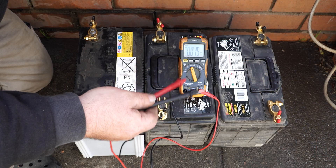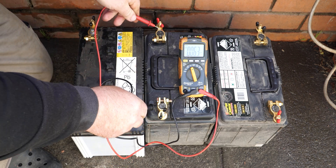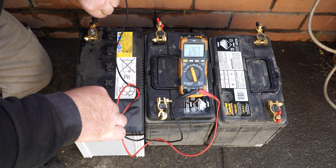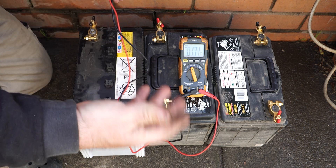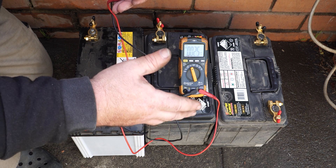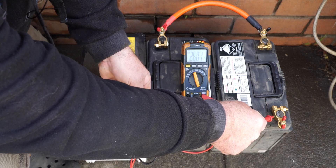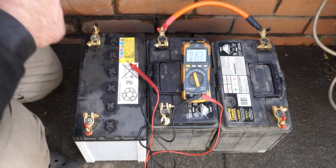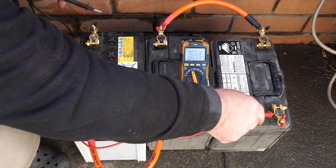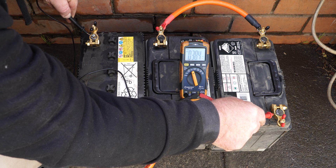Now let's get out there and do some welding. We have three lead acid starter batteries. The first is 12.94 volts, the second is 13.06 volts, and the final battery is 12.64 volts — I've topped them up with an AC charger. Putting two in series gives us just over 26 volts. Adding the third in series — negative to positive, negative to positive — and checking from the far positive to the far negative gives us 38.4 volts, which will drop a little under load but is around 36 volts. Close enough.